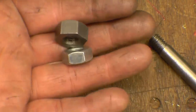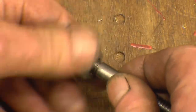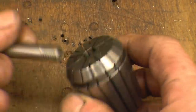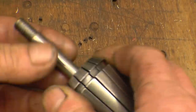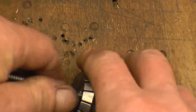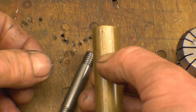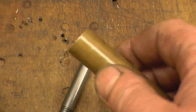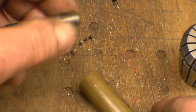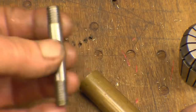There's a lot more material in it, it looks better — just better. Metric threads do come apart when they're rusty; Whitworth threads don't. I need a method of holding these. A collet will get a decent hold on there, but I don't think it'll get enough of a hold to cut that thread without damaging the threads. So what I'm going to do is put some threads inside a piece of brass — probably about that long — and then split it. Then I can grip that in the collet chuck and it should squeeze together and grip on the actual threads, gripping the whole thread over a much larger surface area.